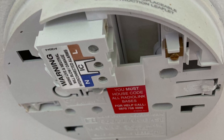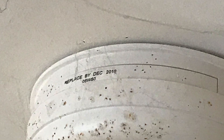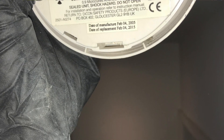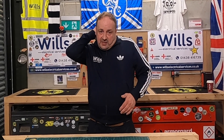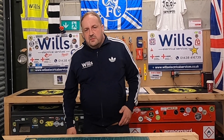For smoke alarms, most have to be fitted a minimum of 300mm away from a wall, light fitting, edge of wall, loft hatch, or anything like that. I always check the dates and if they're out of date I put it down as a further investigation. I attach the manufacturer's instructions to the report, and if the customer doesn't want them changed they have to write me a letter — it just covers my back. It doesn't sit right not having up-to-date smoke alarms considering the value of the property.